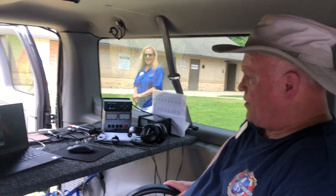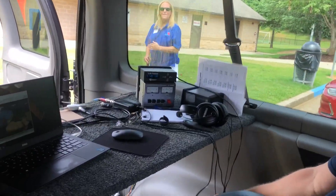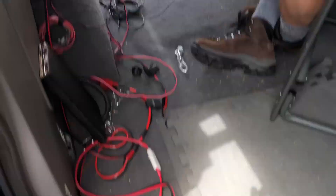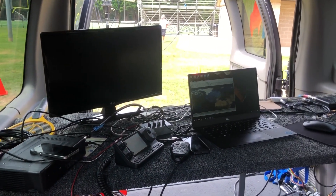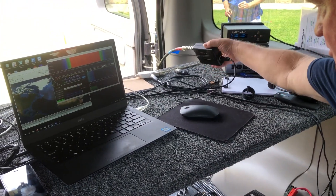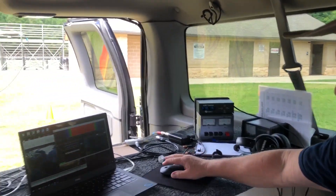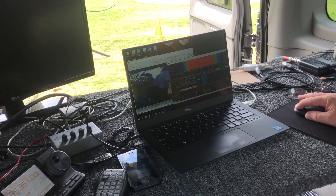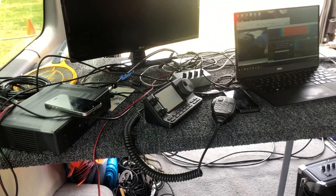Daryl, you've got a whole setup here in the van — a desk and chairs. We've got this nice large van; we might as well use it for field deploying satellite activities like this. What kind of power do you use? We're running everything off 12 volts. We've got a couple of things that need 110 — there's a little inverter running off a big AGM battery and then another small gel cell battery for everything else and a spare. So I'm using a software defined radio receiver — a little SDR play. That inputs into HDSDR, which is a free software program. It's very robust. That's the receive side.